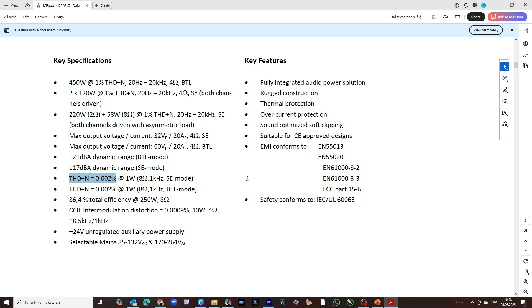It has low total harmonic distortions for those who follow that metric. Importantly, total system efficiency is 86% — roughly 85% for simple calculations — meaning 15% goes to heat. We need a good design with good airflow; otherwise this board has a tough time constantly working close to maximum temperatures.